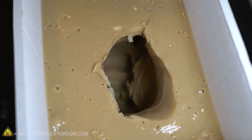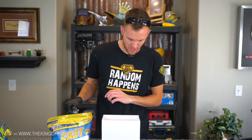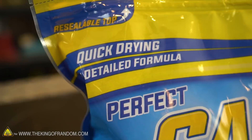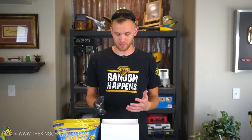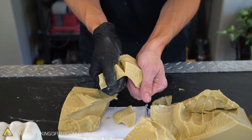Hand slid out pretty nicely. You can see down in there the hand-shaped cavity — our alginate mold seems like it's working great. My hand came out of there without destroying too much. Now we need to mix up a batch of our casting material. We want to do this immediately after finishing the mold because an alginate mold does not keep very long. If you want to extend its lifetime, you can keep it in a sealed container with wet paper towels — that can help it stay viable for a couple of days, but you really want to cast into it right away.